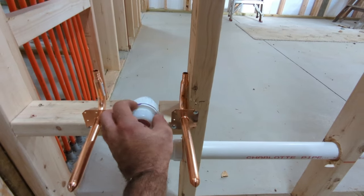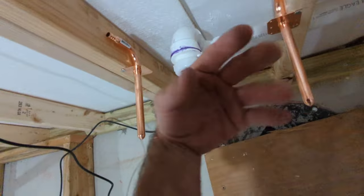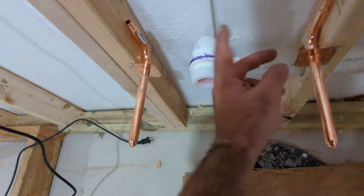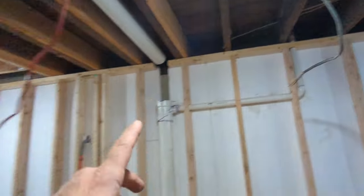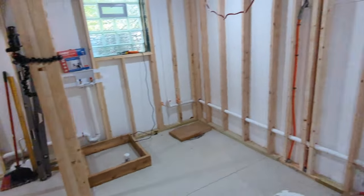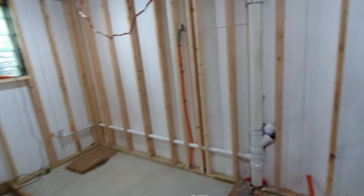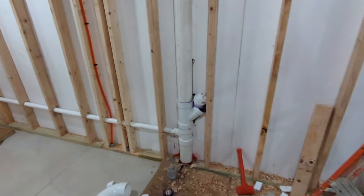We'll put an adapter nut into that orifice, and then we'll turn, like I say, go back in and tie into the stack there. Same over here. I'll just cut this off, throw a couple elbows and a nut in the oopsie pile, which is a very small pile, and we'll just go up to a sanitary tee here and go back over. So that's what we'll do tomorrow. I'm glad I stopped where I did, because I haven't done anything more than consume, like I say, $30 to $35 worth of components. Not a big deal. I'll grab what we do need with the next material run, which I'll kick things off with tomorrow, so I'll make a list before I leave here.